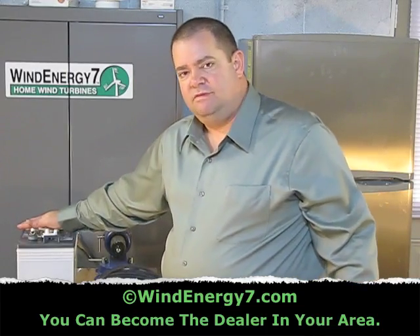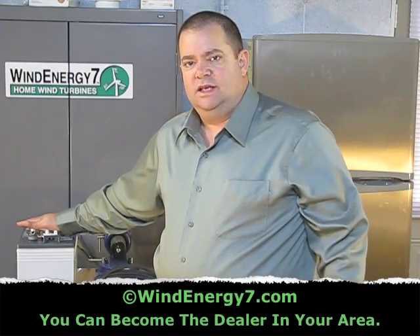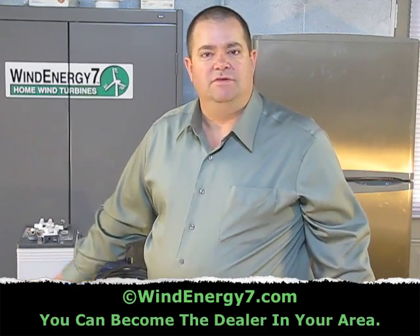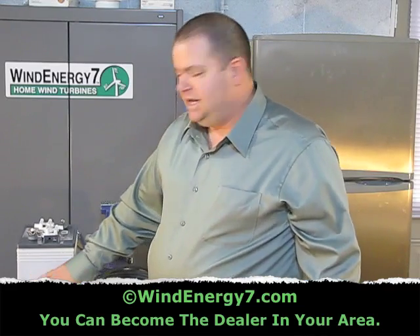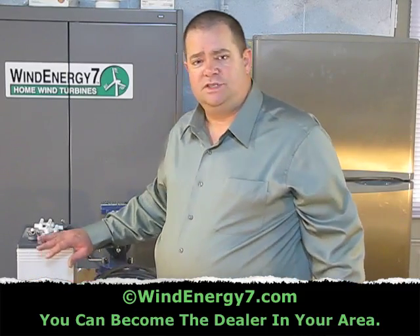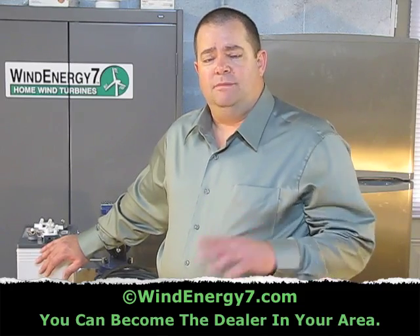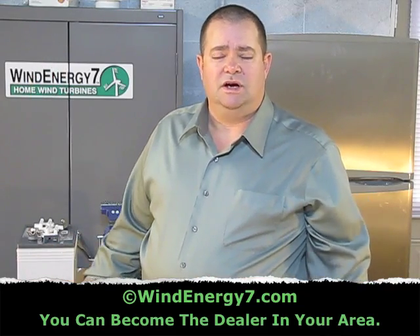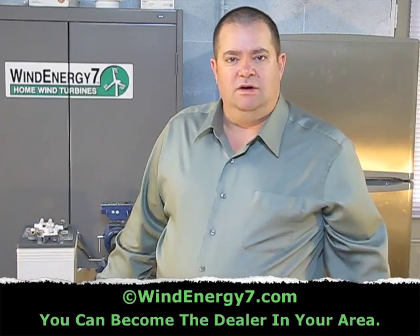The price of these batteries is going to run anywhere from $75 to $100. This exact same battery in some solar boutique — a lot of PV solar dealers will sell you batteries for $200 a pop. It's probably one of these batteries with a different sticker on the side, just rebranded. These are deep cycle, 6 volt, 232 amp hour batteries that will stand up against anybody's solar battery costing two or three times as much. That's why we don't sell batteries — because most of them are a rip-off. We just show you where to get the batteries, explain them to you, and let you buy them without any markup. Additionally, we don't want batteries being shipped all over the United States, using up fuel and causing pollution, when you've got batteries right there in your own town. Source them locally, keep the money in your own economy.